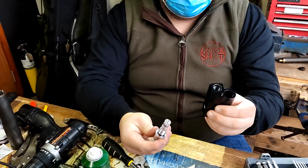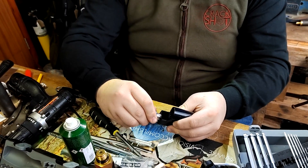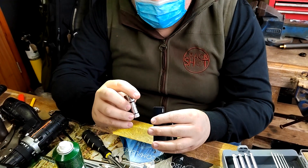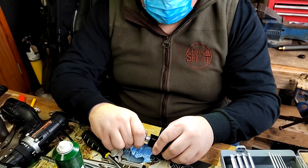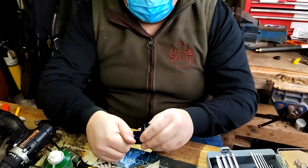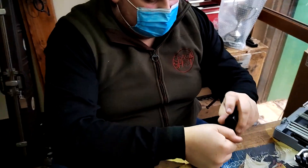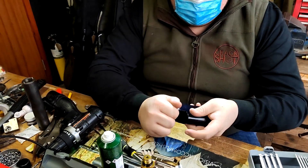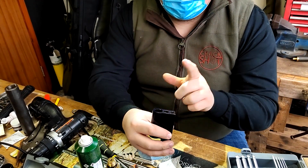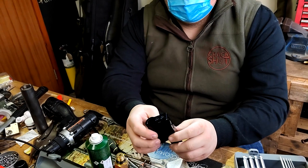Basically — regulator, regulator block. I'm just going to go in and seat that little ring because it's starting on the threads. Sometimes it can be just a bit of a — there we go, just to work the bottom ring over there. I've never seen this before — I've heard about it a lot, people talk about it, but I've never seen this happen. I think this is going to be really useful for people. That's it — the regulator is fitted. I'm just going to go ahead, change the seals on the actual block, re-seal the gun, and then we'll do another pressure test.